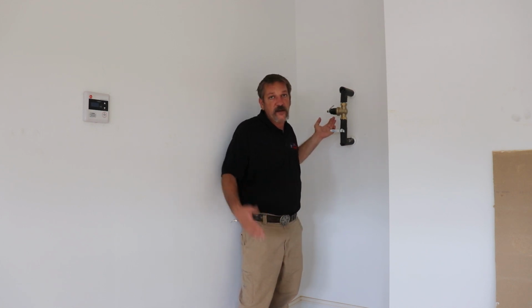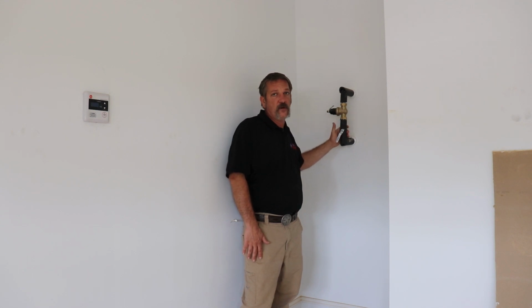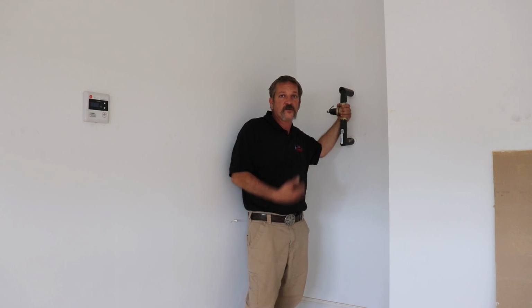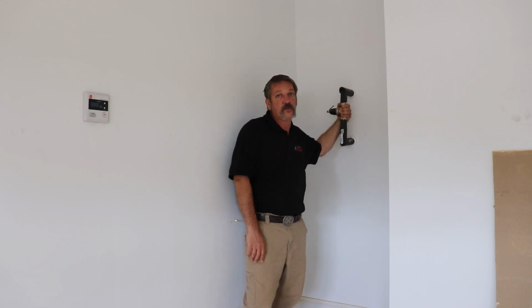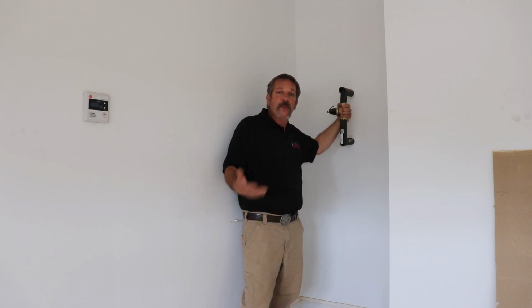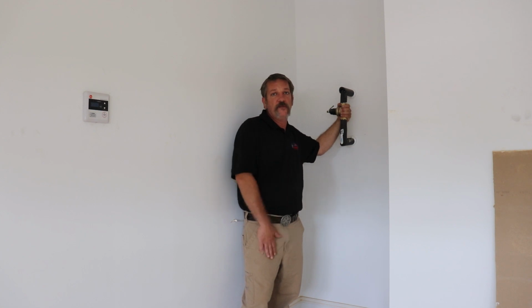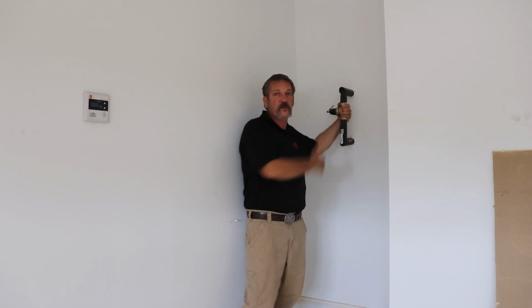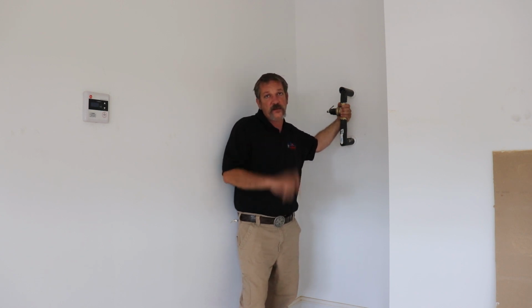So once you've checked everything, you're going to turn this water on. So you're going to turn that ball valve on. Now, most of the time, you're going to feel it right here, the water traveling through. And you want to be listening too for things running. But most of the time, somebody's flushed a toilet, so you're going to have a toilet filling up. And you can feel the water moving through this brass thing here. And it'll gradually slow down as those toilets fill up.